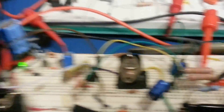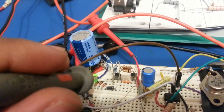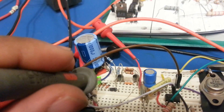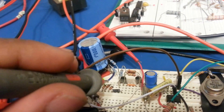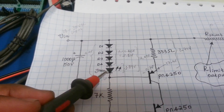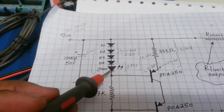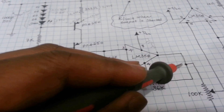I've demonstrated that this voltage is able to go all the way down to zero. The neat thing about this LED is that the LED I'm using to drop down the voltage can actually serve as a power-on indicator for the power supply. So it serves two purposes: not only does it drop the voltage to feed the cascode circuit and bias the top transistor, but it also indicates that the power supply is on.